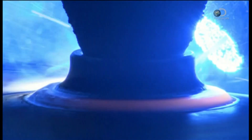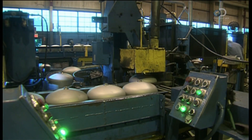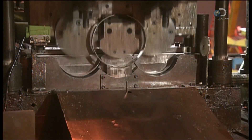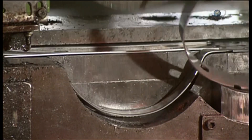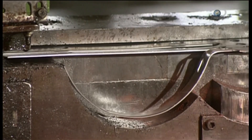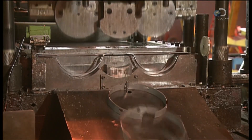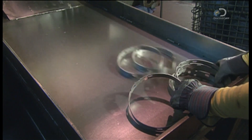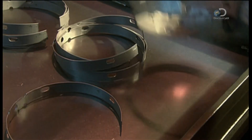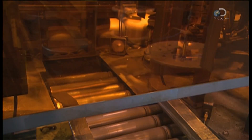The flanges are fused to the tops at the welding station. The weld has to be perfect so it can take the pressure of compressed fuel without exploding. A die simultaneously bends steel strips into rings and punches holes in them. These rings will be used as pedestals, and the holes can be used to mount the tank to a barbecue. A machine then welds the rings to the bottoms of the tank shells.